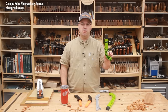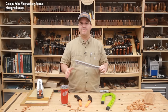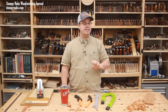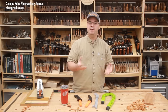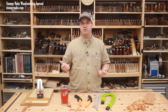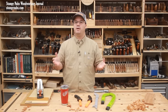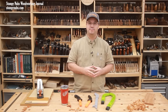This video really isn't about the push stick — I'll link to it below if you want to check it out. The points I really want you to get from this video are that push sticks in general are not inherently dangerous. In fact, they're important safety devices that you should be using, whether you make one or buy one. If you do have a plastic push stick, it's not necessarily dangerous either, but some discount-priced versions may be made from very hard plastic that can shatter or kick back when they contact the blade. So if you think yours may be too hard or brittle, consider replacing it with a better one, or make one yourself from sturdy straight-grained wood. And finally, as a general rule, don't be careless with any of your safety devices — like a seat belt in a car, we use them hoping we may never truly need them.